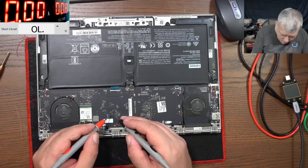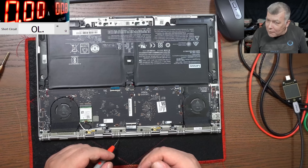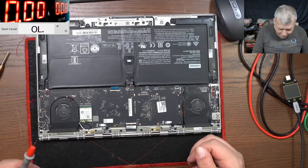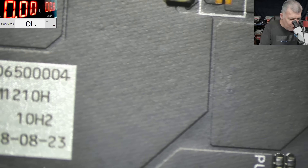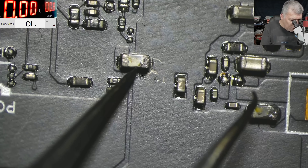Let's check for short - same capacitors. No short... no, this is impossible. How can there be two motherboards with the same fault? What are the odds? This job was booked in only two hours ago. That's crazy. Do you think it's the same fault? Looking at the back of the motherboard - check there - that's mechanical damage. The capacitor was pressed or pushed down. And this one the same.